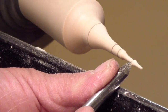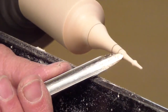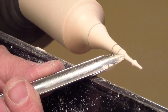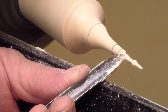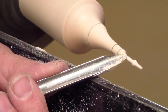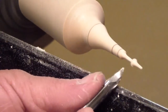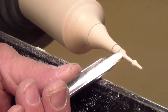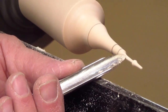And you have to be gentle, you have to have quick depth perception. If you're wearing bifocals, you might need to get a different prescription because the lathe is about 6 inches further away than your reading is. And the main reason I know that is I have a lot of students that have bifocals and they're kind of sitting there looking for where the tool is. And it's just out of their focus range. If you're lucky and both eyes have the same problem, you can buy safety glasses that have 2X or 4X lenses. And once again, I've got double contact, and I'm slicing that wood off.